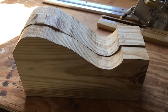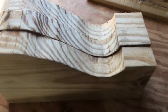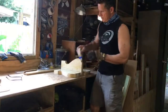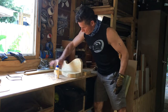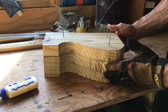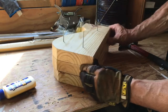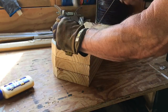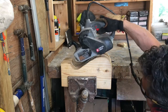I am not the most skilled bandsaw operator around, so those are the three pieces cut individually. But don't panic — I'm going to show you how to fix that, because I actually am a pretty good sander. Take the two outside pieces and put glue all over them, spread it around real good — I prefer just using my fingers. Slap them together and square up the edges, then take three nails and randomly place them on both sides. The only thing you need to be concerned about is squaring off the bottom and the back edge, because we're going to shape all this off anyway with saws. Countersink your nails.